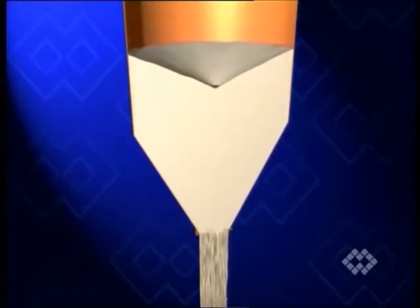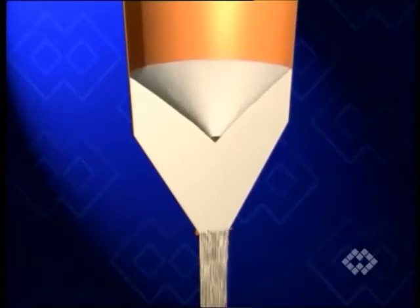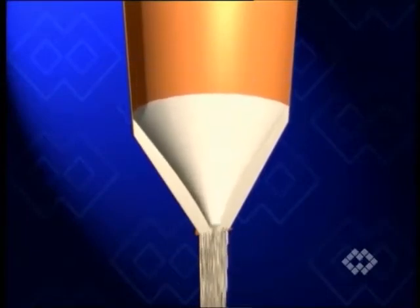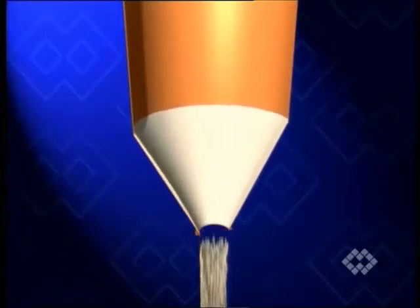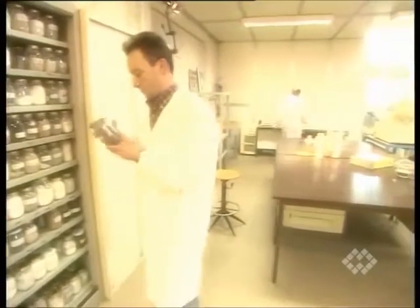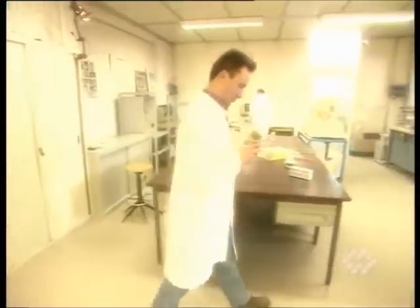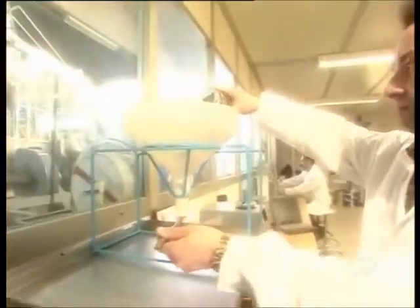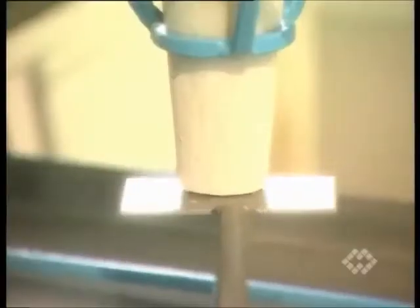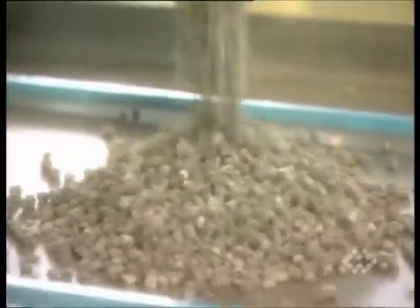Nevertheless, central mass flow is evenly transmitted to the outer silo section from where, through inertia, material slides down more slowly but without any interruption. Unfortunately, only very few bulk materials show such flow characteristics. The majority cannot be extracted from silos, bins or hoppers without some kind of flow aid.